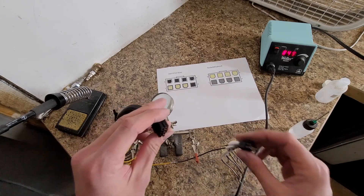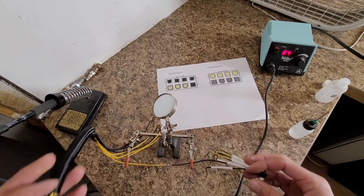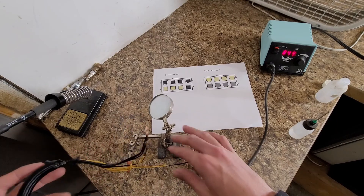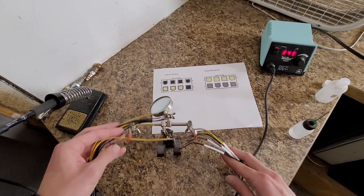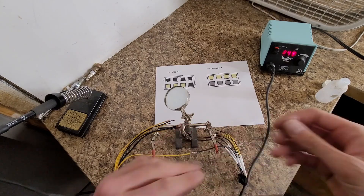As I did in my other video, I labeled the connectors indicating which pins are what. The gold pins are the 12-volt. I have my handy little diagram here of the pinouts of how the connectors should be wired. I've started the process of using the helping hands and the soldering iron to make the splices. The method I'm going to use is to take the ends of the wires, spread them apart, jam them together, and then twist them.